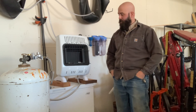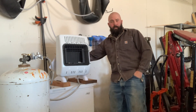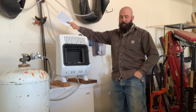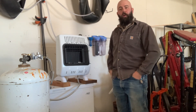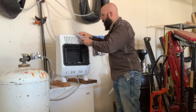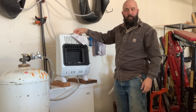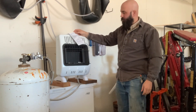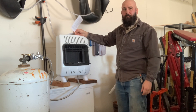The first thing we're going to have to take care of is the pressure coming into this heater. There's a tag attached to the back of the heater and it's got specs on it. This heater is calling for an inlet pressure of between 14 and 7 inch water column. To convert it to PSI, that is 0.25 to 0.5 PSI.